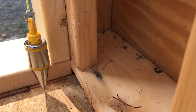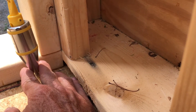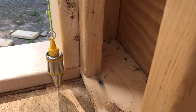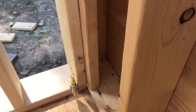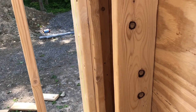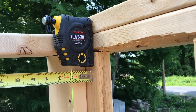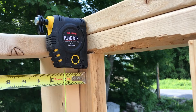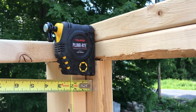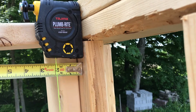This plumbob here is on a nylon string. It has settled a little bit. The way you work a plumbob is you attach it at the top of the wall and you measure the distance from the wall to the string. I'll come up and show you. This particular tool is a plumb right — it's a plumbob on a reel. Very cool tool. It's got a pin up there that you drive in that holds it.